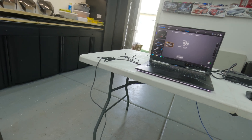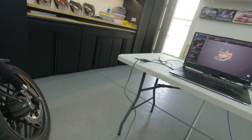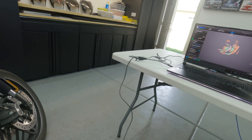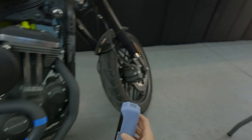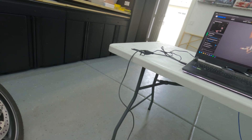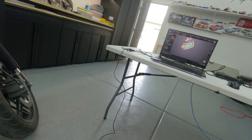I press the button, get the preview going — looks good. I bumped up the exposure a little since there's so much black. Now I'm just starting to scan, working my way through the key area while also capturing a few miscellaneous things for tracking markers. Since the exhaust is a round object, having other reference elements around it helps the scanner track better. I'm now moving into the main exhaust area — probably overkill but might as well get a little bit extra.